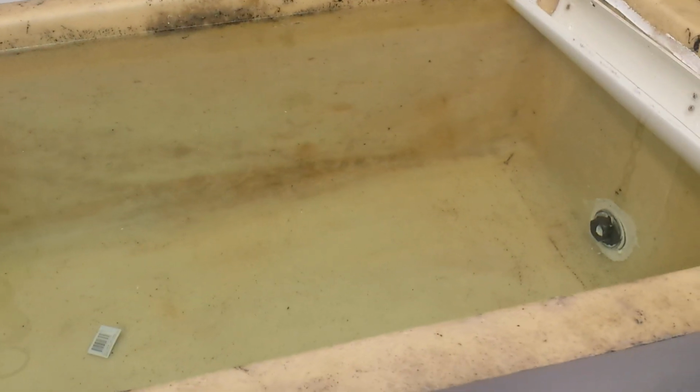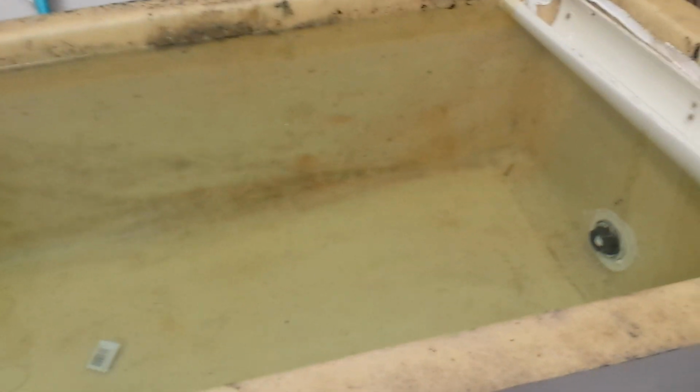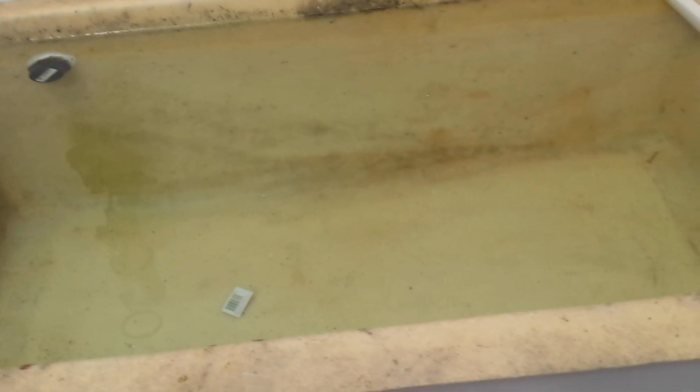So that water will sit at that all the time. As the water temperature drops, if I need to, I just turn the hot taps back on, and it bumps it back up again. So what I'm doing is just using a hot water service, and that works out a lot cheaper than running a great big element inside the tank,